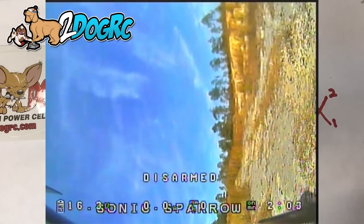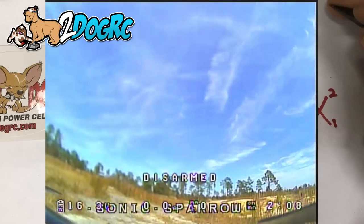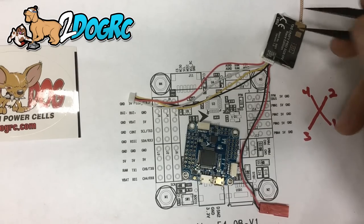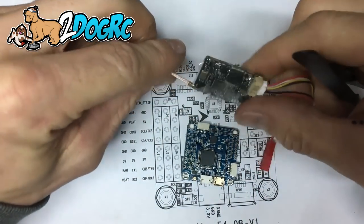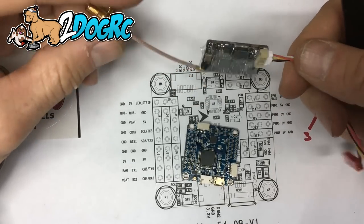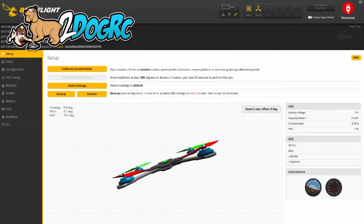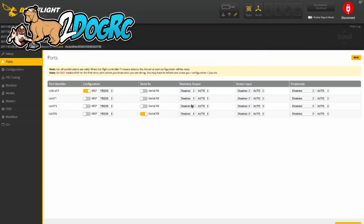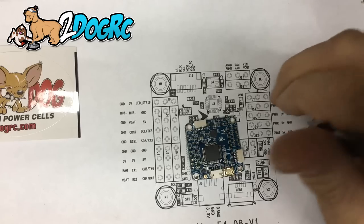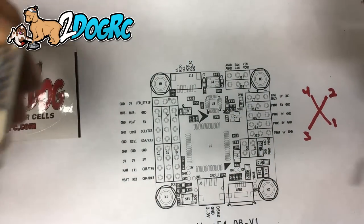With smart audio you can change your frequency via the sticks on your transmitter — you can go in your OSD on your transmitter, change the power, change the frequency and band of your video transmitter. That means you don't have to figure out any switch buttons or push buttons. Very, very easy. That's why I would highly recommend it — it's almost stupid not to. This also works with the Immersion Tramp. Once you connect to there, go into the Betaflight ports tab — on UART3 you're transmitting out from the flight controller, so set that peripheral to TBS, and then you can go in your OSD and change it.